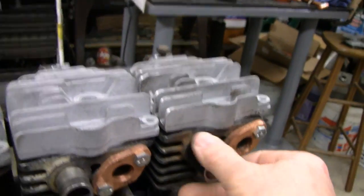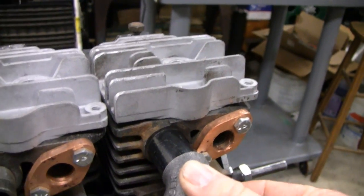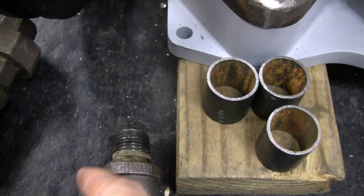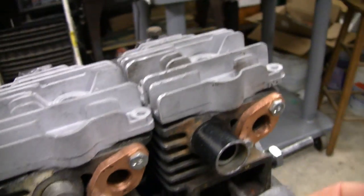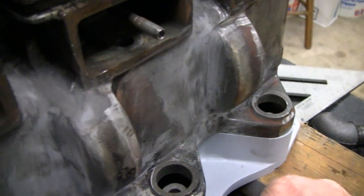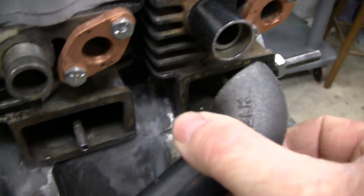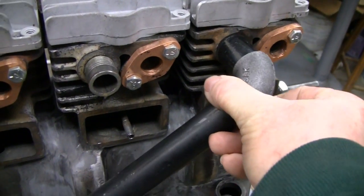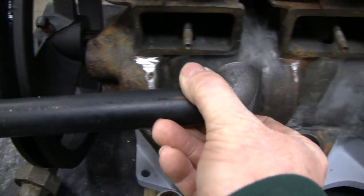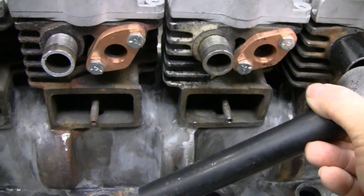Once we have this sleeve on there, I've got regular half-inch pipe fittings and we're gonna weld them on — I'm not gonna use the threads. On the regular fittings there's a big knuckle, so we cut those off because we don't need them. What I'm gonna do is have the pipes coming down on a 45, each one of them into a pipe coming out the side and sticking out about two inches past the pulley.